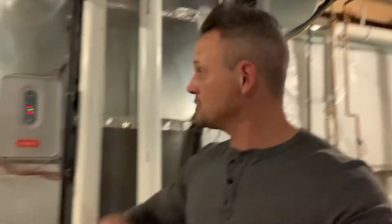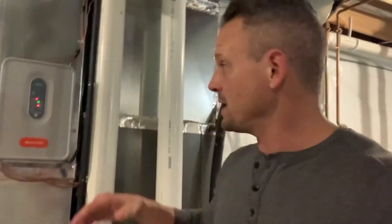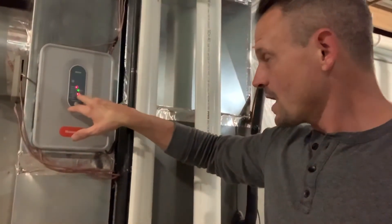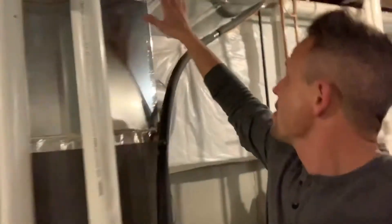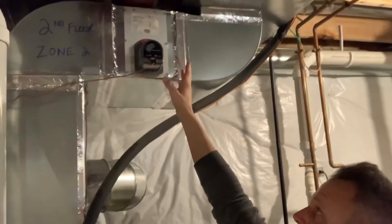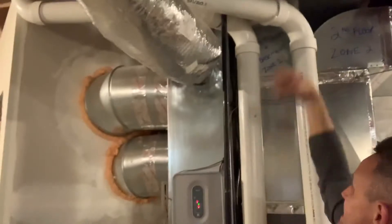Now, just the opposite. Let's say you turn on the thermostat on the second floor. You can actually have both of them on at the same time — then everything would be open and you'd have airflow throughout the whole house. But let's just say the first floor thermostat is off and the second floor thermostat is on, whether it's heat or air conditioning. What you'd see is zone one would turn red and zone two would turn green. This damper would go back open, and then the first floor damper — which is on the other side of this ductwork — would close, pushing all of that air to the second floor.